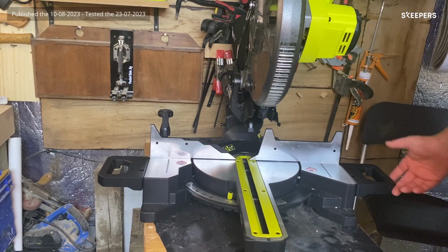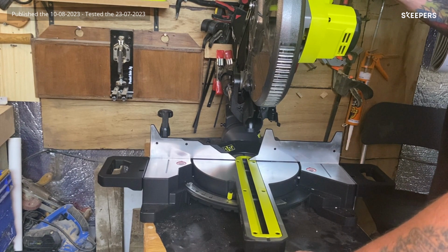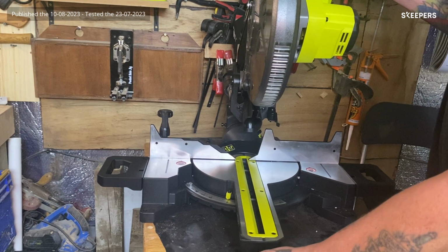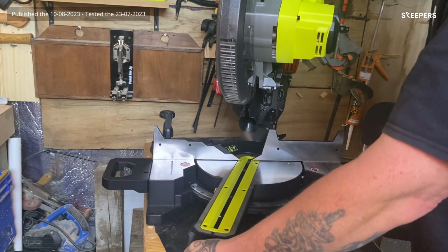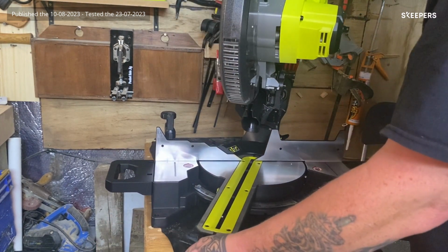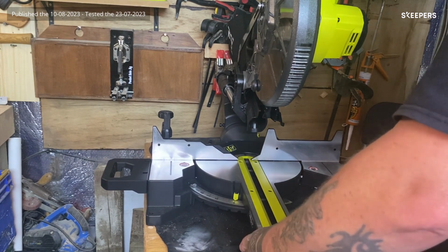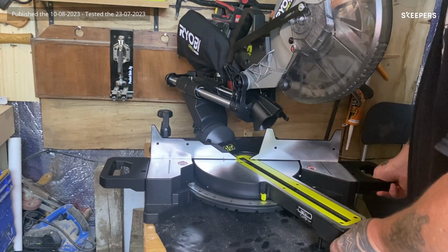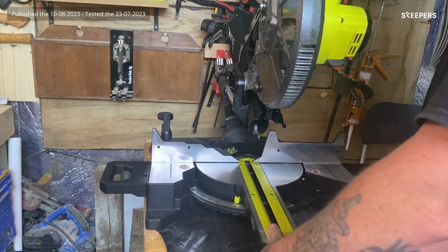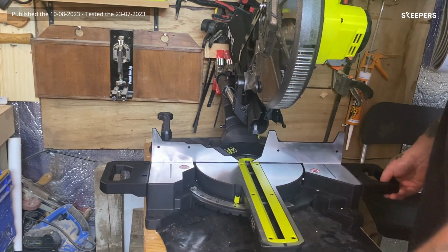It's spinning the saw around at the front. As you can see here, you've got the locking knob for once you've set your angle, you can lock it in place. However, it does have indents for every mitre. On the underside there is a second lever, which means it doesn't catch on any of the predetermined angles, but with it pressed, the lever clicks back into place. Then you would screw it in and that's got that locked.